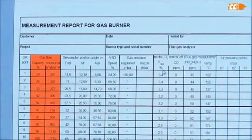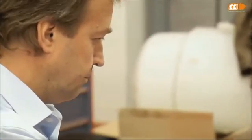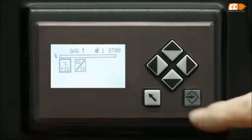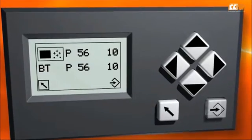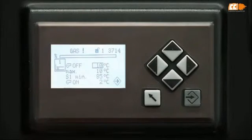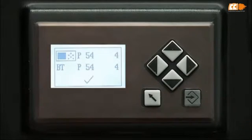Remember to fill in the measurement report for the burner. When the burner adjustments have been made, it's time to set the boiler operating temperature or pressure. After that you need to set the on and off operating limits. Enter the PID menu and set the boiler temperature or pressure limit values. The preset option for the capacity controller in the burner control is automatic, depending on the burner and boiler conditions. You might need to change this to atmospheric conditions or external firing rate input. For more information, refer to the manual.